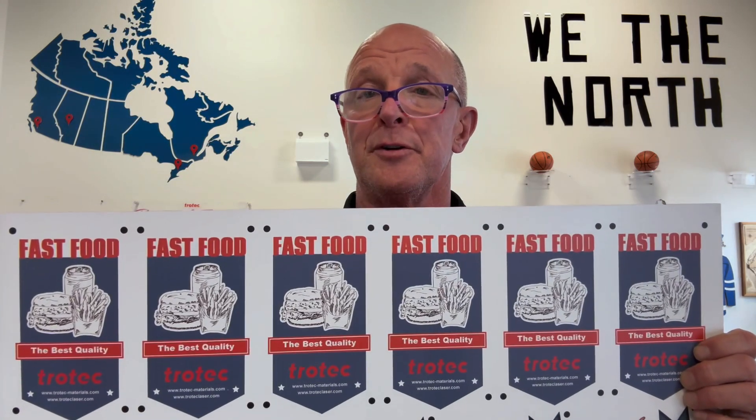It's very important that we have a fast and accurate system. The Trotec job control vision is perfect for that — it's an excellent system. It will read the registration marks and accurately place the artwork so that it doesn't matter where we put the material on the bed. The laser machine will go out and read it. The last thing you want is to print six millimeter acrylic and have the cut not line up properly.